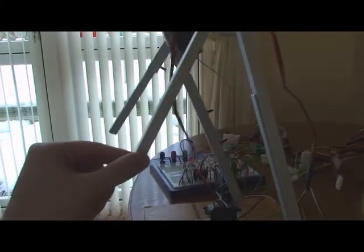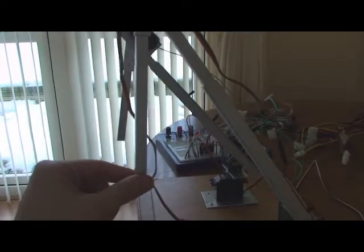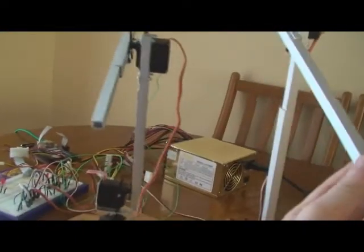You can see about this point that the output arm is at a much bigger angle than the input arm. And that's because the input arm's about 5 centimeters longer on both parts, so the output arm has to lean forward and open out just a bit more to reach the same coordinates. That's just done automatically by the equations.